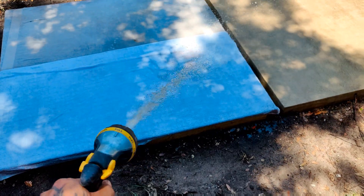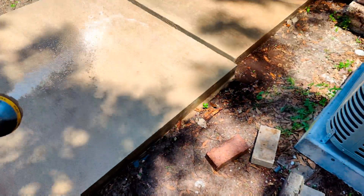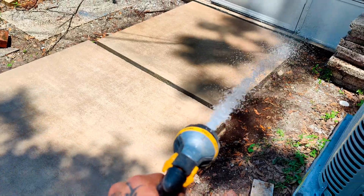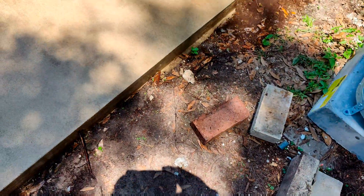I like it too and I'm actually having fun. What I want to do is make sure I make it strong, because I really want to do a driveway. I haven't seen anybody do a driveway with dry pour yet — I might make history. I'm thinking rebar, maybe some fiber for extra strength, maybe six inches deep. A contractor friend said four inches is enough, but I might go six with rebar and fiber and a proper curing process.